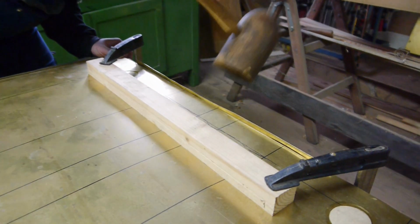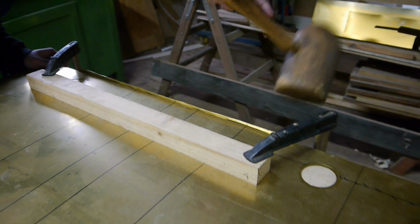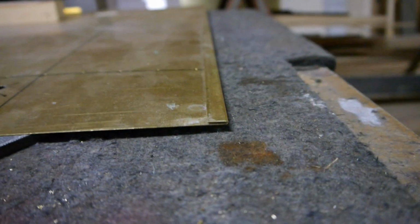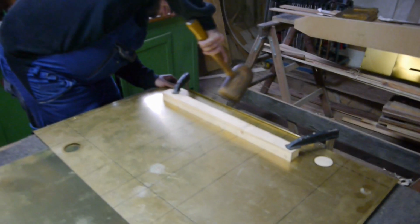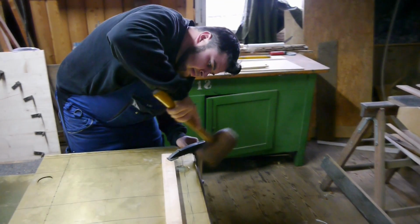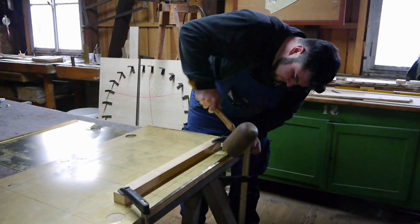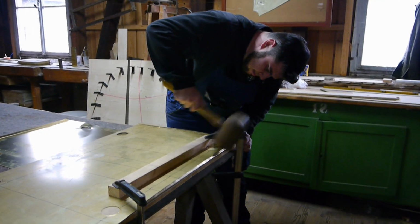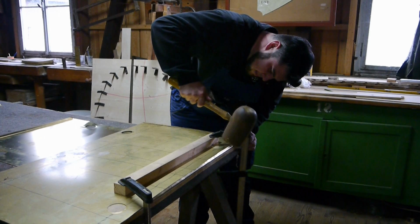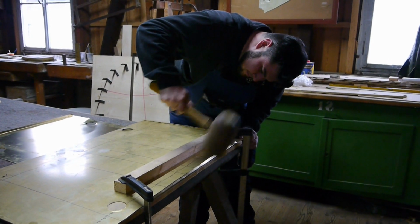After Matze has cut all the tank mantle sheets, he has to fold the ends for the bedded seams that close the fuel tank eventually. And that's what he's doing here. Easy and gentle, Matze, don't hurry. Leave the metal time. Never torture the sheet metal.